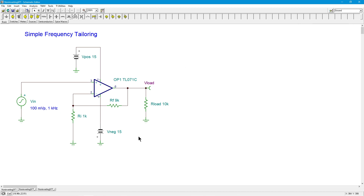Suppose we find that that upper break frequency of 300 kilohertz is a little bit too high. Maybe we're getting some noise in the 200 kilohertz range, or at 50 kilohertz or 100 kilohertz or something like that. Is there a way we can reduce the gain in those areas? We could make a proper filter to precisely tailor the frequency response, but I'm just looking for a very quick and easy, low cost kind of thing. The same thing would be true on the bottom end — maybe we're having issues with infrasonics or low frequency content and don't need it to go all the way back to DC.